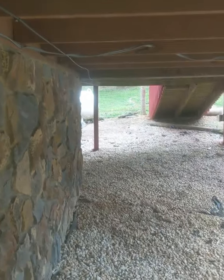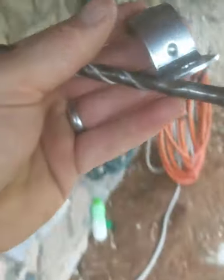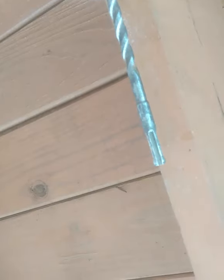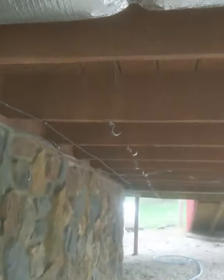I'm going to teach you guys how to make a story pole. What a story pole is: I'm going to put straps on for this pipe and use this drill bit as a gauge — you can also cut a piece of pipe, a piece of wire, or use a stick — and I'm going to use it to set my straps at the same distance every single stud. That way, when you look down the run, it'll look crispy clean and neat.